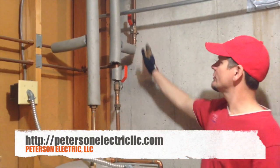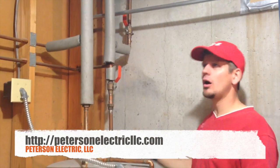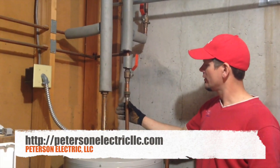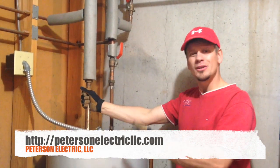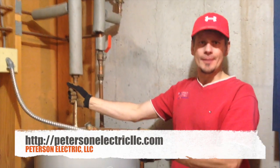Most of the time this water valve is on another side from where the hot water heater is, or the hot water heater is upstairs. A lot of older homes have the bonding right at the cold or hot of the hot water heater, or by the washer machine, or even underneath the kitchen sink — that's how they did it back in the 70s and 80s. No longer are we allowed to do that.